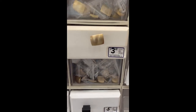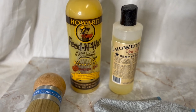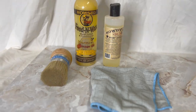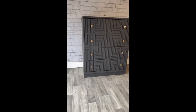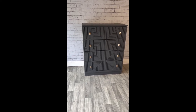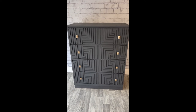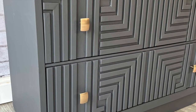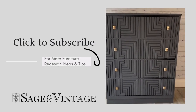This was the hardware I selected from Home Depot. To seal the piece I used Heavy Duty Hemp Seed Oil from Dixie Belle applied with a microfiber cloth in a circular motion, then the chalk brush to buff it out. I used feed-in wax for the inside of the drawers — it makes them smell really good and brings out the natural wood. And there you go — that's how you get a high-end dresser on a budget. I submitted this piece for the Makers Challenge and got runner-up, which is super exciting as my first challenge. Thanks for watching — click below to subscribe for more redesign ideas and tips.